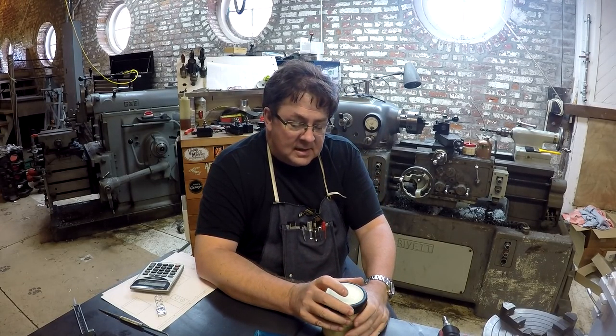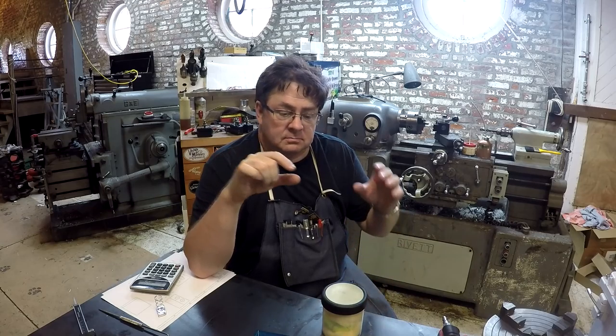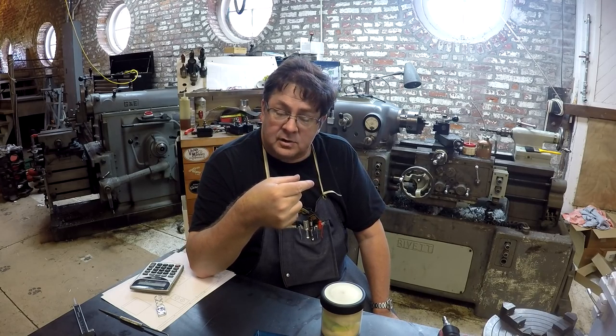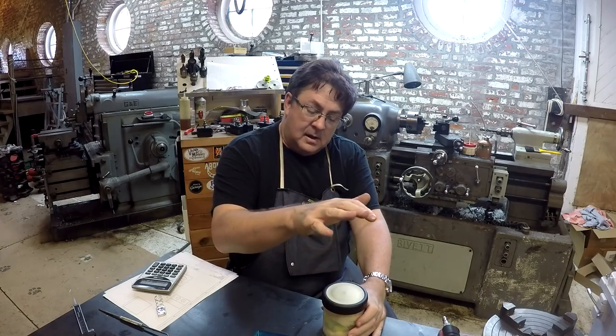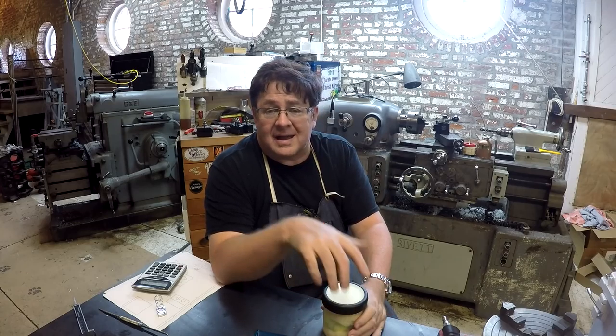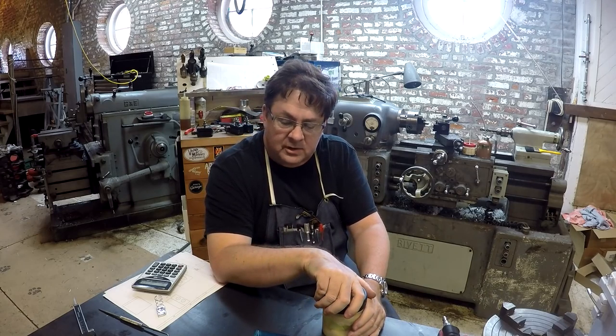And I had a little gift for Chuck, and you know, Chuck was making the screwy balls. Neat idea, fabulous idea, where he has a ball bearing with a flat on it, and you place the flat against your vise jaw, and you use the point as a single point to hold an irregularly shaped workpiece, or for squaring stock that's not perfectly straight or perpendicular. I will provide a link to Chuck's channel and video on the screwy balls, and it's a very, very nice addition to your tooling set.